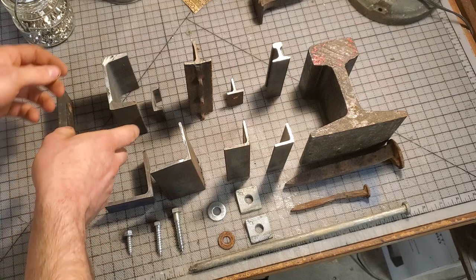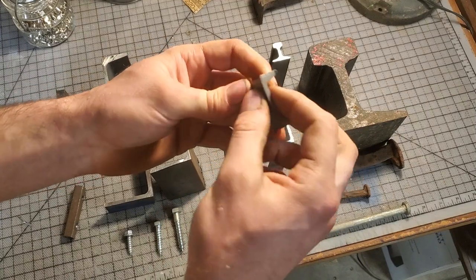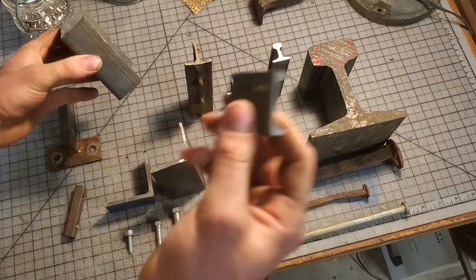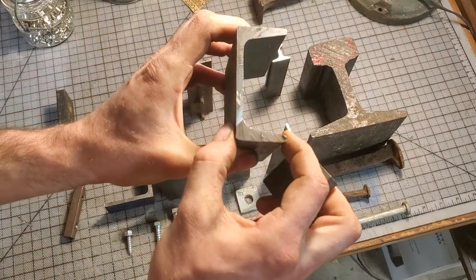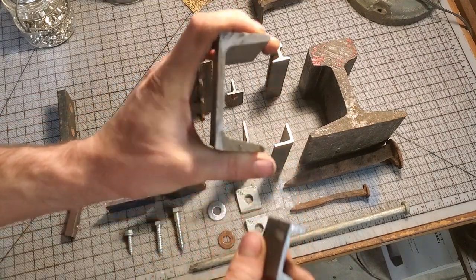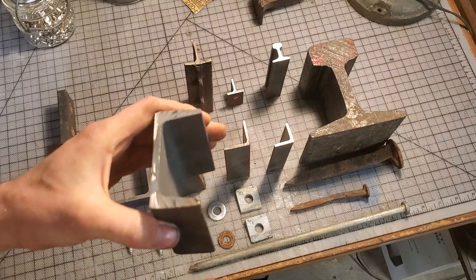What I'm currently using is this 1½ by ½ by ⅛-inch thick channel. I've thought about using this for a while. It's like angle in that it comes in many sizes and thicknesses. This larger piece here is 3-inch by 1¼ by about 3/16 thick, which I use for cart frames and chassis. Based on the size difference, unless you're doing much heavier rail, this bigger size is only for carts — you don't want to use something this big for your rail, as it'll be very expensive and harder to work.